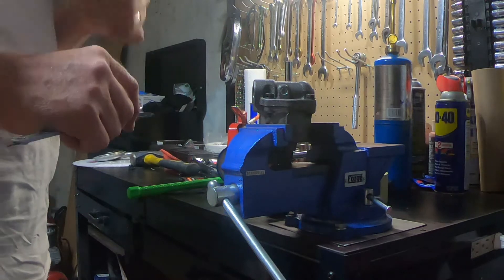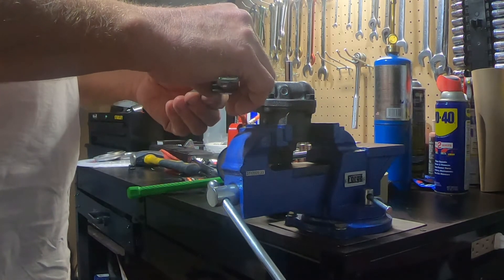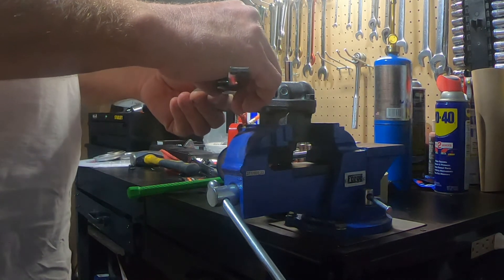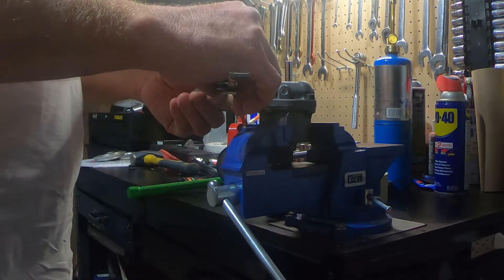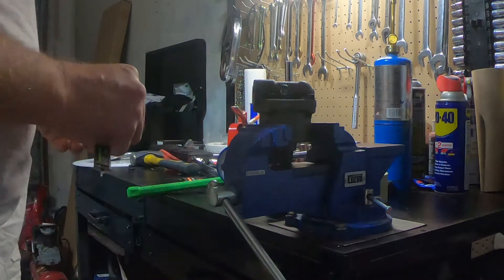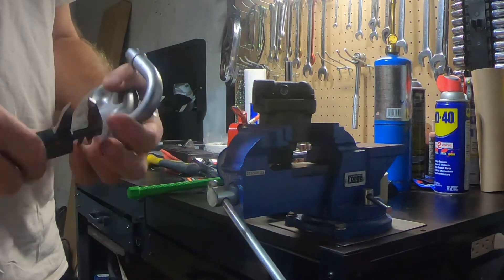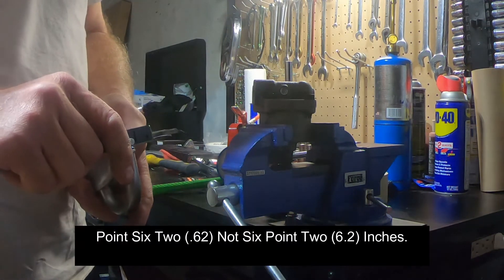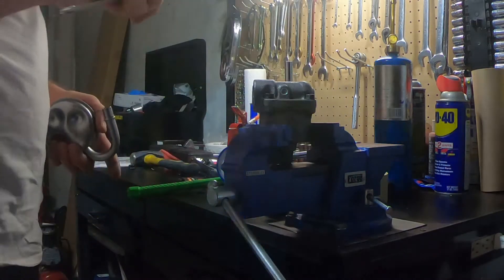But I think this is a little excessive. I measured the inside bore of the oil pump pickup on the pump at an average of about 0.606 of an inch. As it turns out, when I take the same measurement of the oil pump pickup tube, I come up with 0.62 inches. That's a lot.